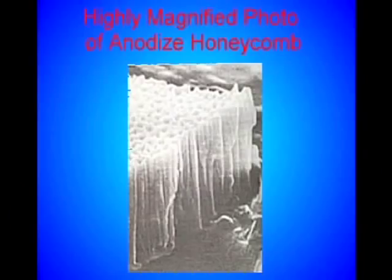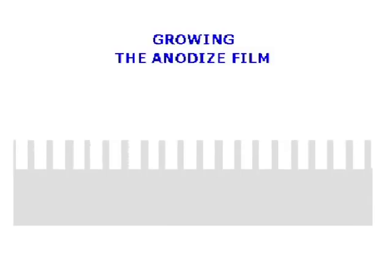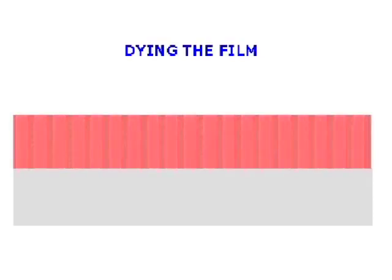Here you can see a highly magnified view of the anodized film. The film, unlike electroplating, actually grows out of the aluminum, a little like rust forming on steel. The thin tubes are transparent and the dye capillates into them. Finally, the anodized film is sealed, locking the color in permanently.